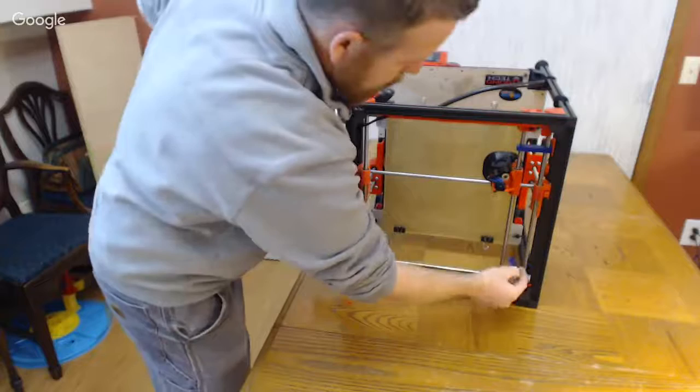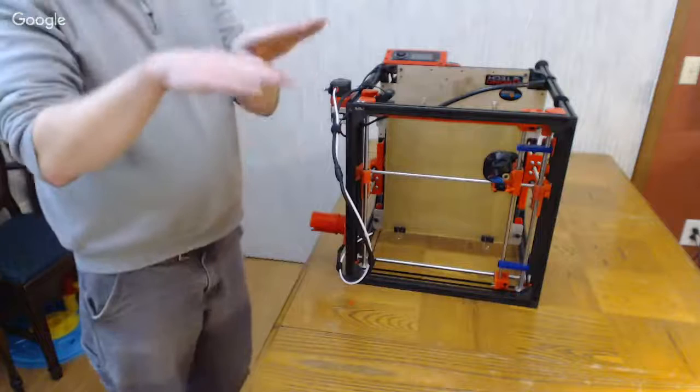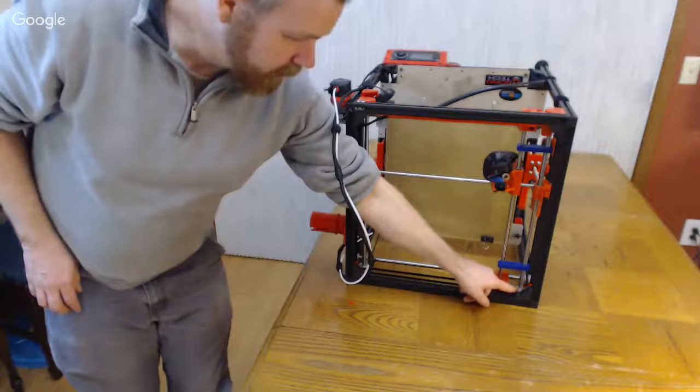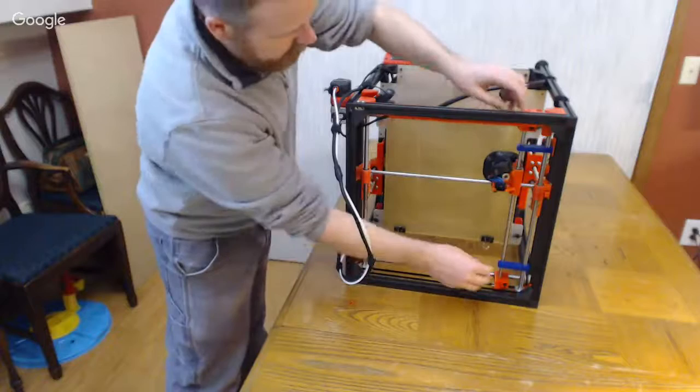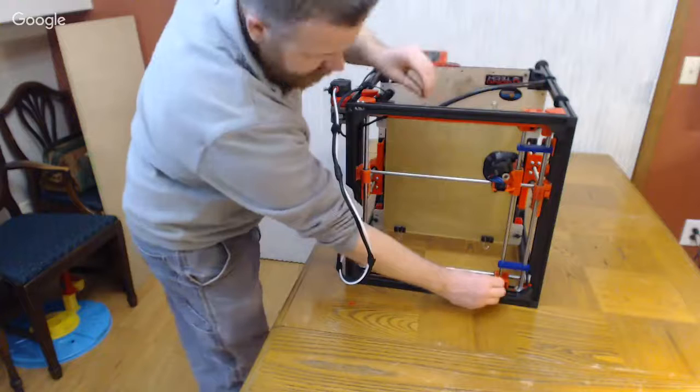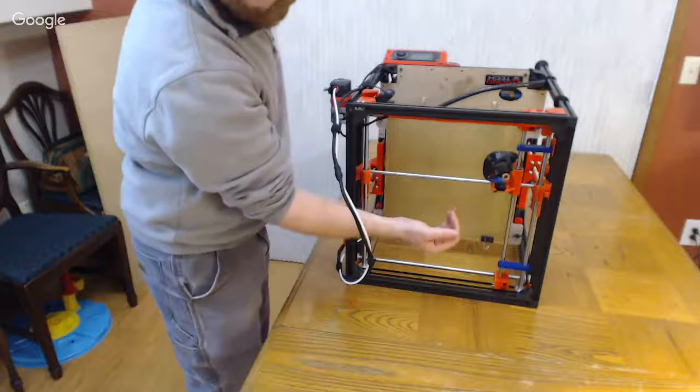Once you have everything leveled and the rods are at the correct height, the pulleys that are on here have set screws on them. If you loosen up the set screw on these pulleys tied to this particular axis, you can move this thing and rack it like this. So you could potentially be out of square. So do you want to have a guide for doing that? Use these things,